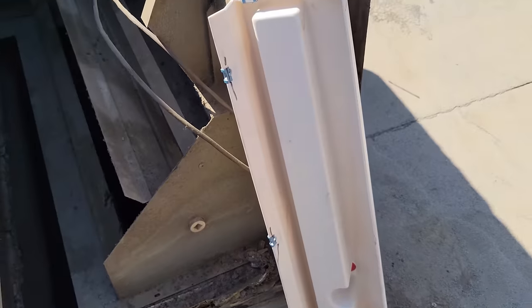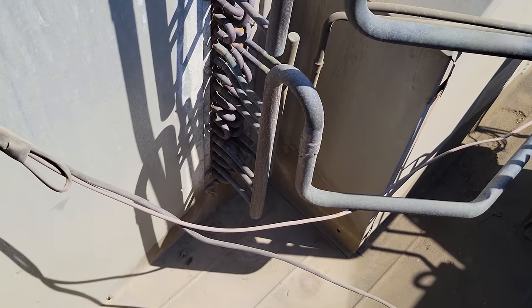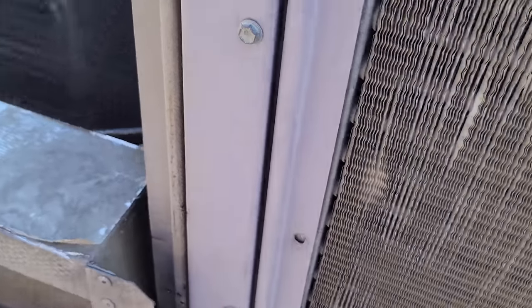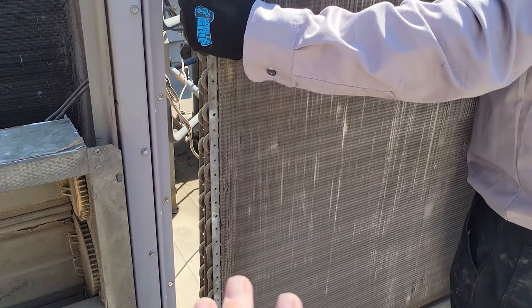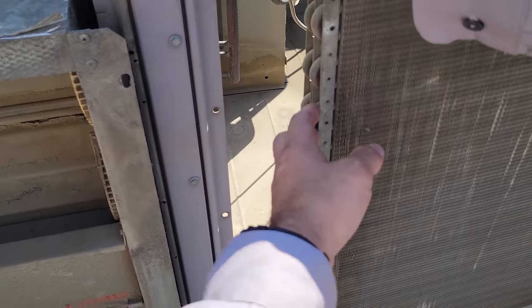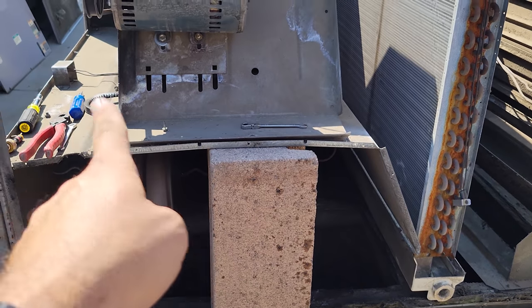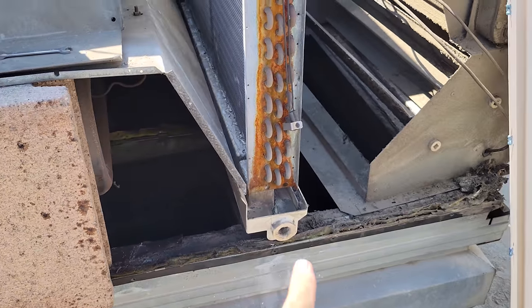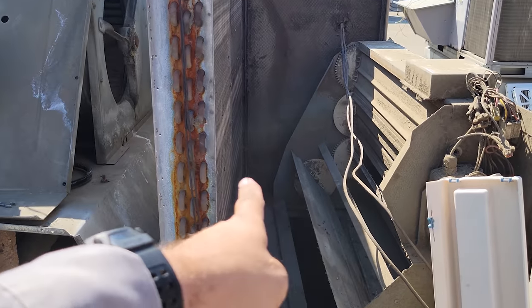On the end of this drain pan there are two screws — those are the ones that are way down in there, so we've got to get down in there too. We're currently working on getting the coil out of the way so maybe we can wedge our way back in there. If this is safe, we've just got to watch it. We recently cleaned this, but I think we might be able to get in there now. We found a cinder block — it's not the greatest, but it's propping this up. We're completely free from the drain pan, but the drain pan is kind of stuck in there — I think it just has some silicone on the other end.